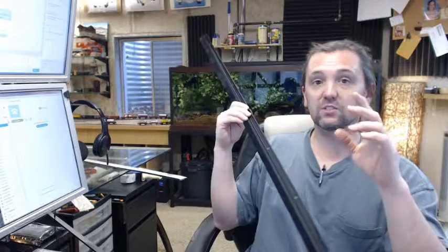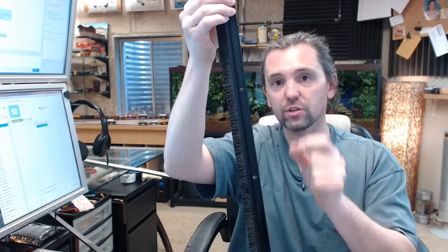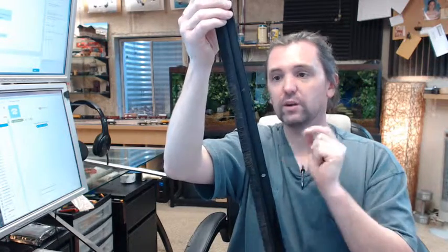It is very likely you would be using this as an astragal — that snap cover is very common to see on pairs of wood doors, aluminum doors, etc. That lateral adjustment is also very critical in getting perfect contact between your bristles. You don't want so much contact that the door closers can't get the doors closed, or they are harder to open, or not effective whatsoever.